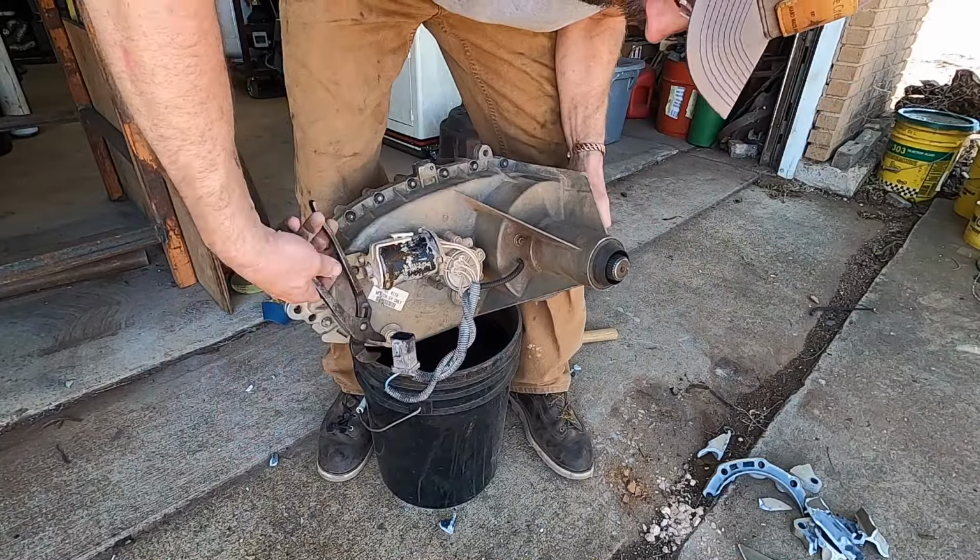Alright, so I've got these pieces to where I can forge them out flat and dress them up some more. Same with this. And then I've got all these thin pieces from the torque converter, I guess. So I'm going to put these together, clamp them up, and run a couple of weld beads so they're held together, and then I can cut it into four pieces and stack it up into something we can forge weld together.